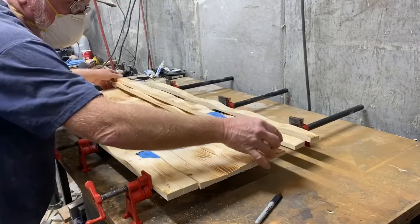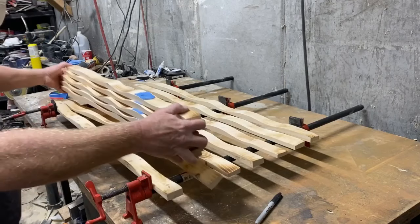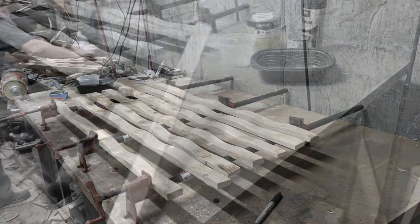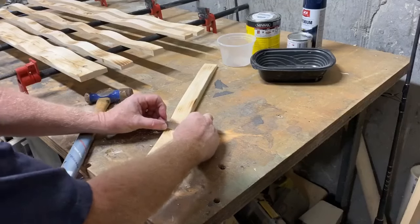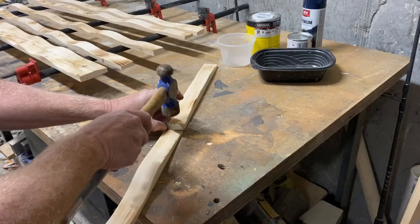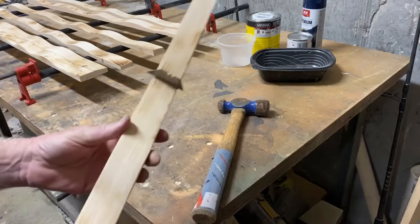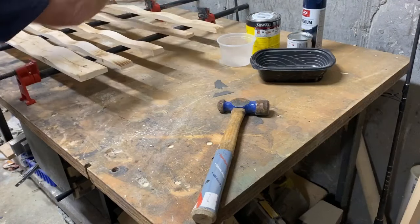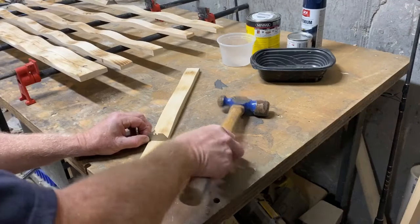And I'm going to remove all of the white stripes, all of the boards that have that painter's tape on it. And I'm going to move these completely off the workplace so that it's almost impossible for me to make a mistake and stain one of the stripes that's supposed to be white. Now that line that I showed you to mark, 15 inches out, that's how long the union, or the blue area, is. I'm going to just hammer in a razor blade, and that's going to help prevent the red stain from seeping onto the area that's going to end up being blue.